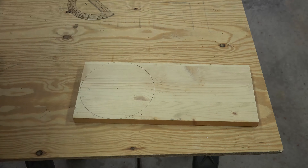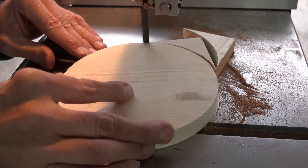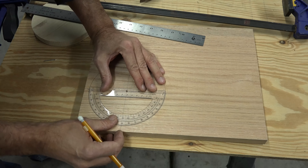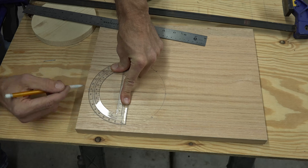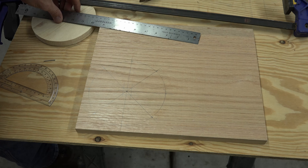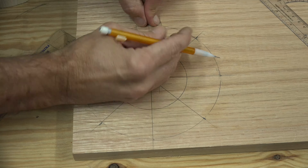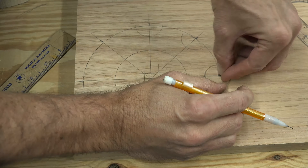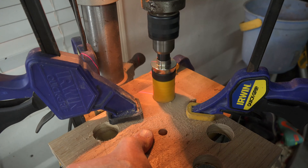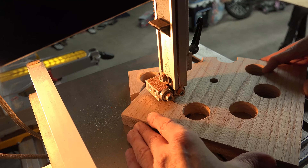With a scrap piece across the top, I will clamp them both down evenly to make sure they are flush with the rest of the box. The good news is that we know the spur is the same size as the protractor. The bad news is I have no idea if I can cut a perfect circle with a bandsaw, so this first attempt is just a test with some scrap wood. Pulling this off just boosted my confidence, so I jump right into the real thing. Now you can make your spur any size, shape, or design that you want to, but I am going to make mine look like a paddle wheel. I draw out my design right on the wood using round objects lying around the garage. After your design is drawn out, you can begin cutting it out. After I used my hole saw to cut out the crescents, I began cutting out the outer edge of the circle.